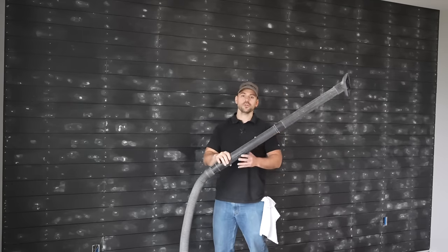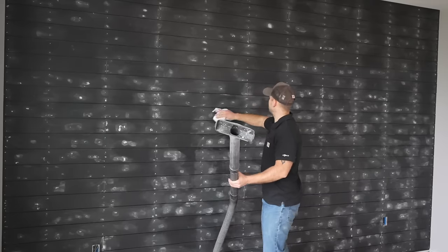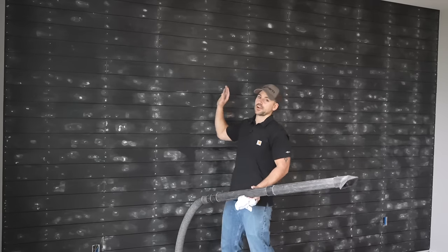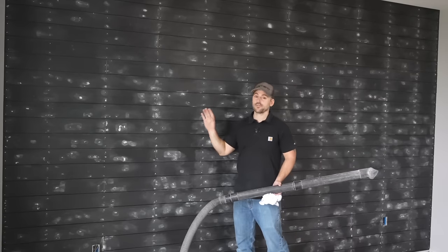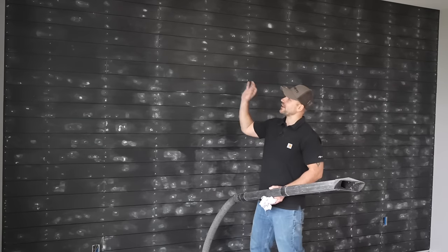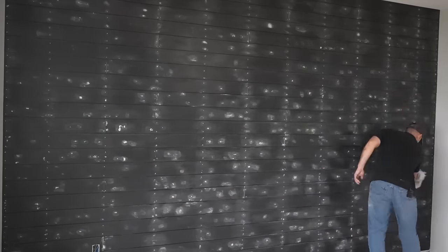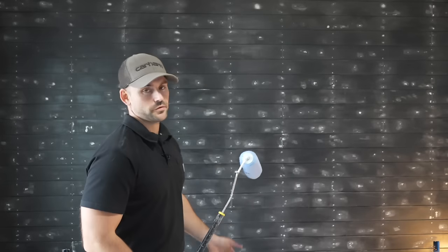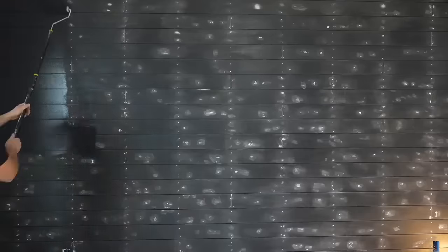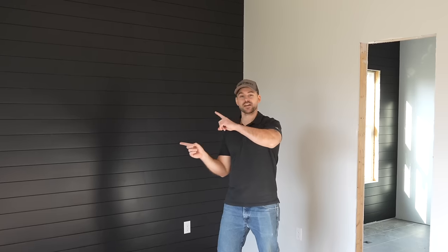With all nail holes patched and sanded, I shop-vac the whole wall, then wipe off the fine dust with a rag. Since the wall is black, the white spackle splotches are very prominent — on a white wall you'd never notice them. I'm using a simple roller on an extension with a half-inch nap, which gives a nice texture rolling right over the shiplap. If you don't want as much texture, use a three-eighths-inch nap. The shiplap in the bathroom and bedroom turned out really good. If you need to know how to install kitchen cabinets, check out the linked video.